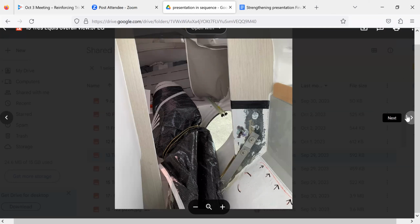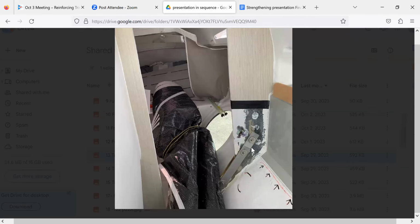I will say I'm a little curious. Again, I'm not a structural engineer, although we have one here, and he can tell you if I'm lying or not. But basically anytime you have a panel with a hard notch in it like that, I'm surprised it didn't break right at the notch, because that's a bad design move. It creates a stress riser. All the forces propagate right there at that inside corner. Is that correct? Yeah, I'm getting a nod.